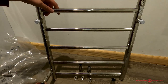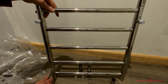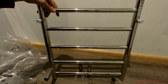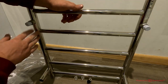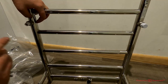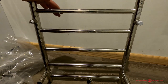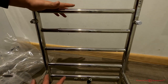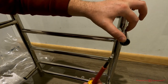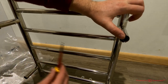Make sure the allen key parts are facing downwards from the way you're going to have the towel rail. This screw screws straight into the hot threaded hole. Tighten them up — don't over-tighten, but nice and firm so it won't move under force. Eye it up and make sure it's as straight as possible. It looks like these ones are actually designed with threads in the bottom so you can put them upside down — that means we don't have to have the allen key sticking up at the top. On the cable side, put one screw on the bottom only, as the top will need to come off to fit the cable in later.